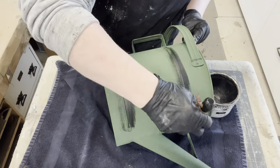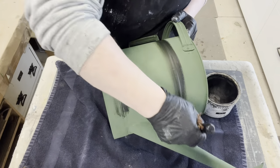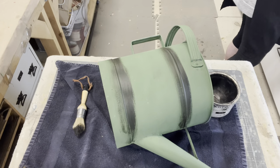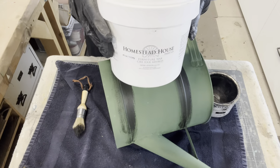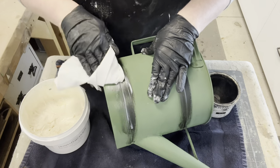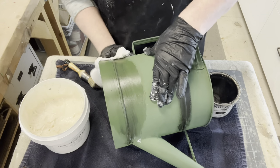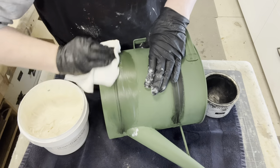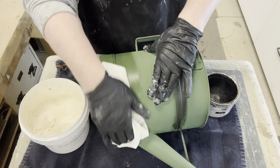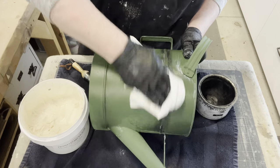So yes, I'm using Jolie's Black Wax on the detailed areas. I know it looks a little extreme — like, what am I doing painting stripes on this? I'm not; I'm waxing it. You need to seal your milk paint in, and I'm choosing to pop my detailed areas and give them some dark black wax to sit as little shadows where dirt has built up. Then as you see, I'm rubbing in Homestead's Clear Wax and blending it all together. Between the black wax and the clear wax, it's just really going to pop the true color of this basil. I know sometimes that process is way scary, but sometimes scary is a good thing if your results are what you were looking for.